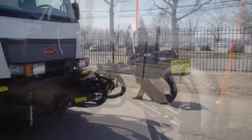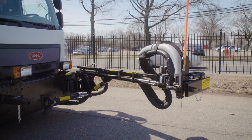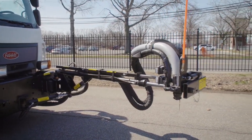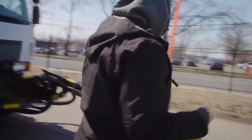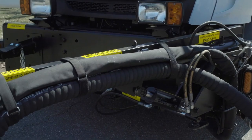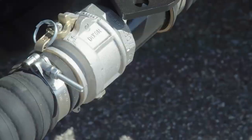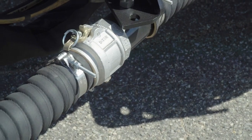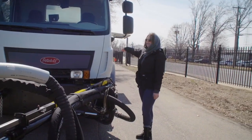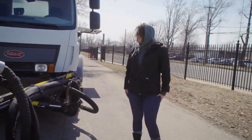The temperature — about 175°F — is what we keep the emulsion at, so it stays pretty hot; you can feel it when you touch it. There's a two-inch gum rubber hose with grease zerks that you probably grease once a week. There's also a quick disconnect here, which is nice — if you have to replace this hose, you only have to replace this half, not all the way back from the feeder. You can section it off; that's a nice feature.